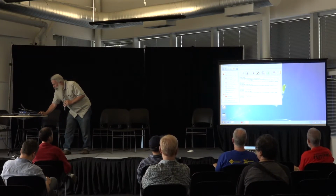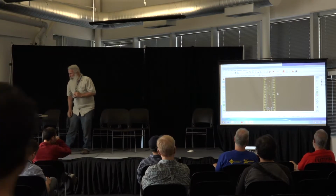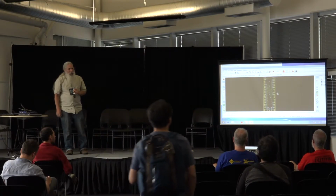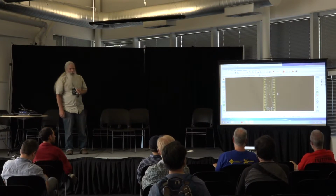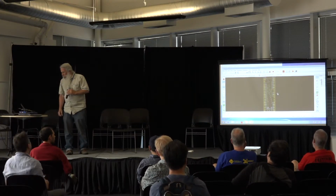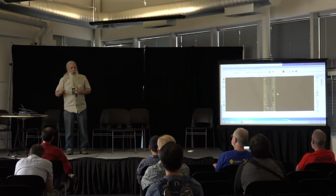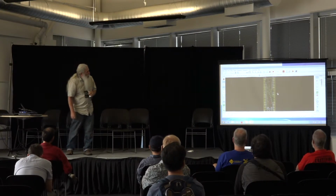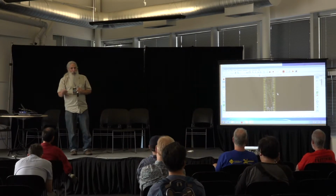Let's see if I can find my, here's one. This shows the actual bottom board that's in there. You can see that the routing, this is all 10 mil spacing. And so you can see how I tried to push everything in there that's necessary. There were a couple places where I was able to move stuff around. The 6532 and the 6530 pin outs are almost completely different. So you see there's a lot of crisscrossing, a lot of flipping over to get the pins to actually cross-connect.